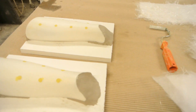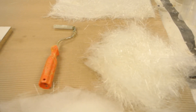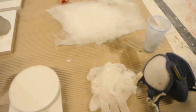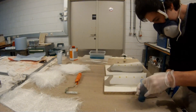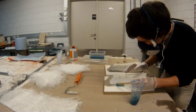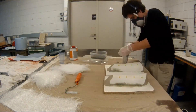Now we're ready for the laminating of the parts. Make sure you work safely — use a mask, gloves, and so on. I have my pot with fiberglass cut into small pieces; this is 300 and 400 grams per square meter. You mix your resin and add a little bit of resin with the fiberglass — it's polyester resin with some fiberglass, which enables me to fill the undercuts.